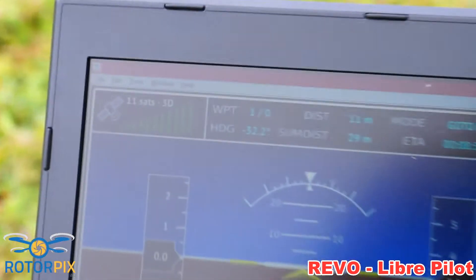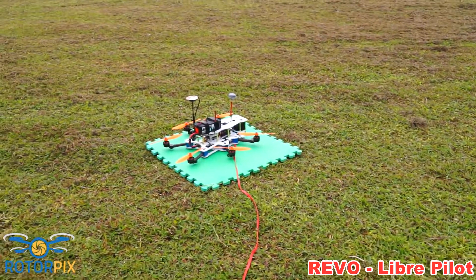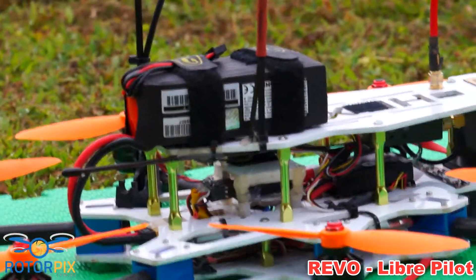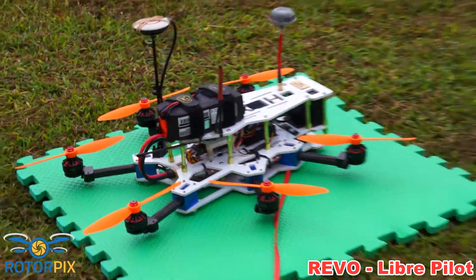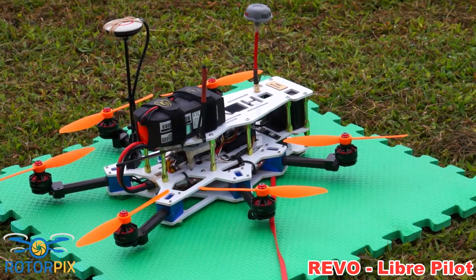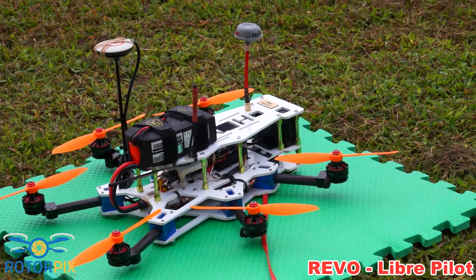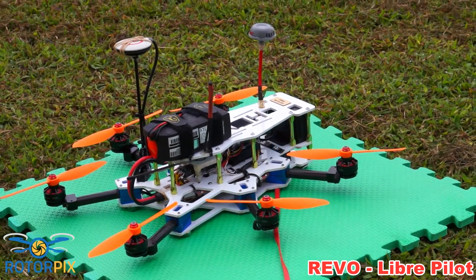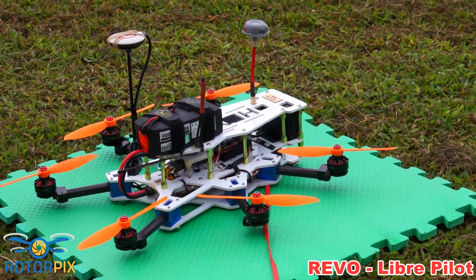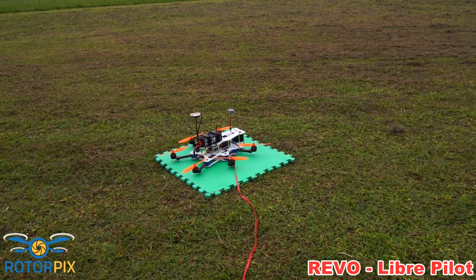So what we're going to do — how many satellites? I've got 11 satellites. I'm going to put it up in the air and see how it goes. I'm also running Crossfire on there, 900 megahertz. I've got a little micro RX just sitting on top of the flight controller. 900 megs gives you much better range than 2.4. My goal is to set up the Revo board and fly around in Acro Plus so I can do some flips and rolls. I've also got GPS hold, return to base, and land. I'm going to set up my failsafe so when I'm flying out far and wide and high, if something happens it'll come back and land — as opposed to locking off the motors and falling out of the sky.